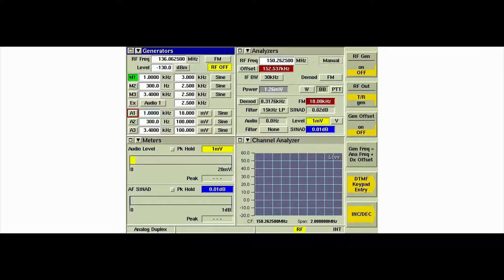Power down the radio and replace the dummy microphone with the radio's microphone. Turn on the radio and place it in test mode by pressing the Home button five times within 10 seconds of the self-check completion. When in test mode, press the Home button once more and set the display to read 4CSQ. Press the PTT switch on the radio microphone and speak loudly into the microphone — the word 'four' works well. Observe the FM level, then unkey the radio.